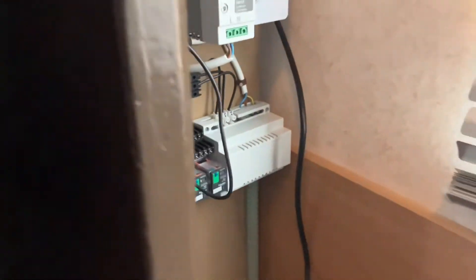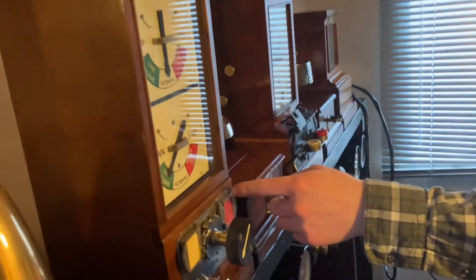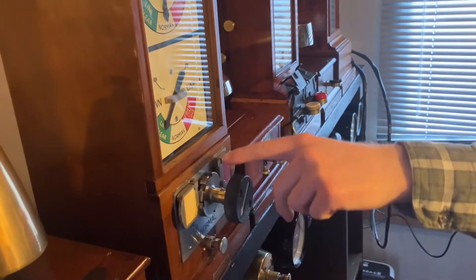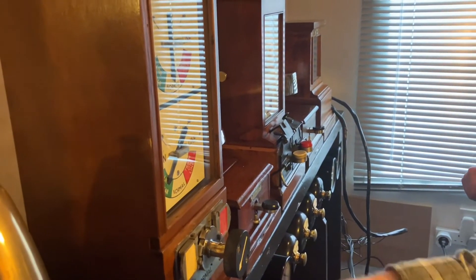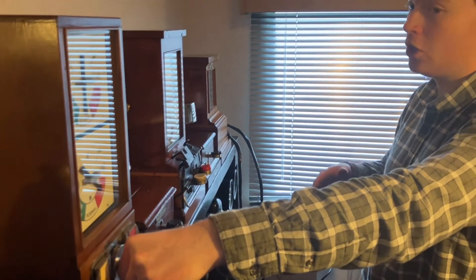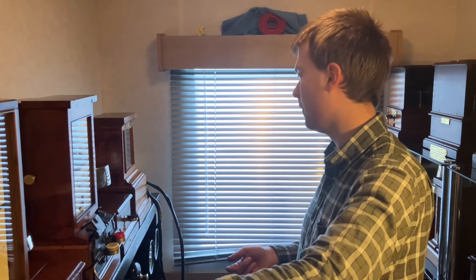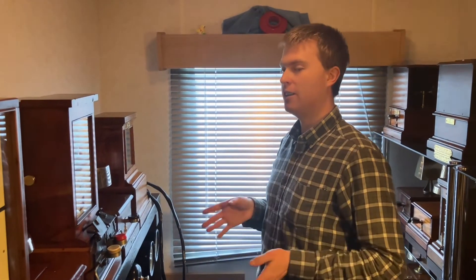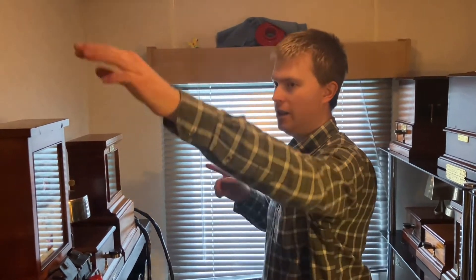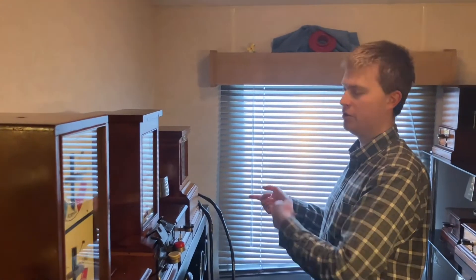On the Great Western, if I was to peg a line clear, that is now sending negative 12 volts through the contacts out to line, and a positive is a train on line indication — unlike the other regions, which is positive as a line clear and negative is train on line. The simulator system can't handle that, because all the inputs need to be positive, so we need to send the commutator inputs to a relay, and then that will send the information to the simulator.